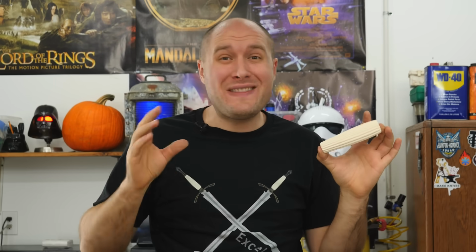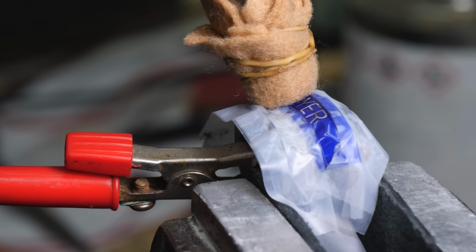It stayed there. The blade is basically tempered like a spring, so it's technically made to move quite a bit, and it's pretty thin. We're ready to move on to doing the gold inlay on the fittings. To start out with, for the front spacer, we need to get a good layout for the very center of the front spacer, and then the center going this direction as well, so I can get my name centered up on there really well.